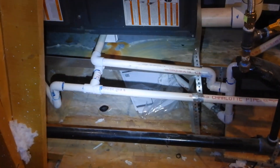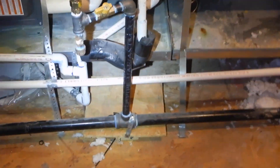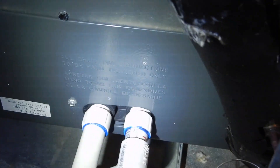If you look below there, there's the care and use manual. Coming up, we're moving on to the evaporator coil over here. They just extended the pan a little bit — that's fine. But this is your evaporator coil, which I cannot read because they painted over it with mastic, so I don't know if it's the right size.